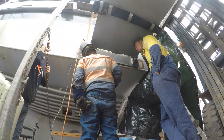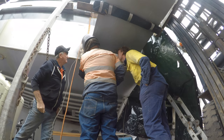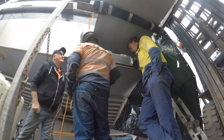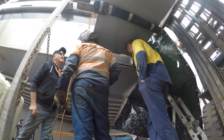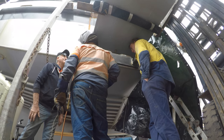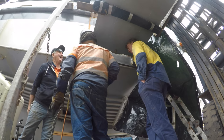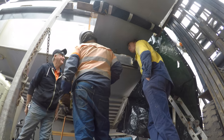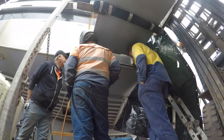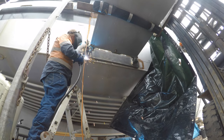When Bruce was welding the doubler on the bottom run, he ended up blowing a hole through into the engine room. We didn't know it, but we had a good look at where the hole was, and on the inside of the engine room, right beside one of the ribs, there was a little bit of pitting and corrosion that went down. So obviously when it got hot with the external welding, it just blew straight through. So we filled the hole with weld from the outside, and then the plan is on the inside we've got to do a little bit of sandblasting in the engine room and do some spot painting and things in there. So when that happens, we'll blast out the weld that's on the inside of the engine room where the hole is, and we'll pad weld on that side so that we get a nice solid cap of steel. Pad welding minor corrosion like that is a common way of solving it in commercial trawlers.